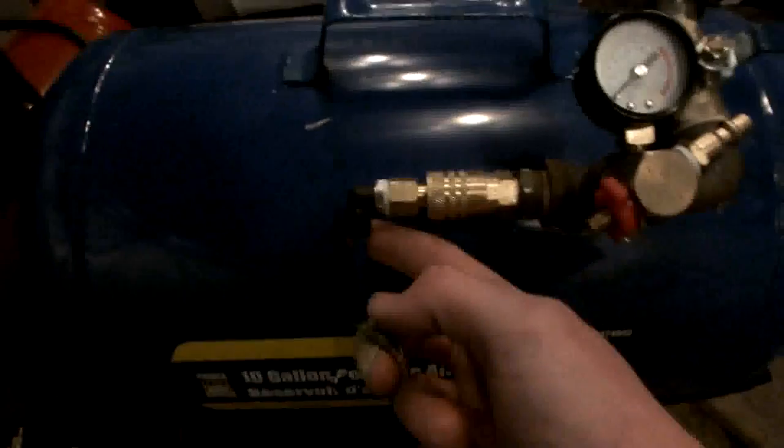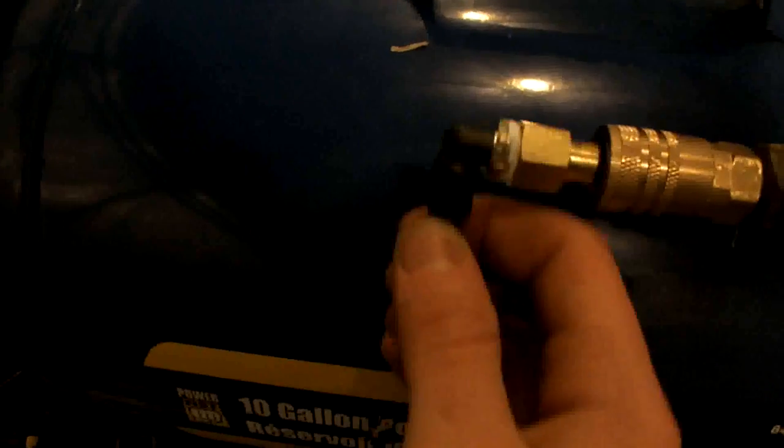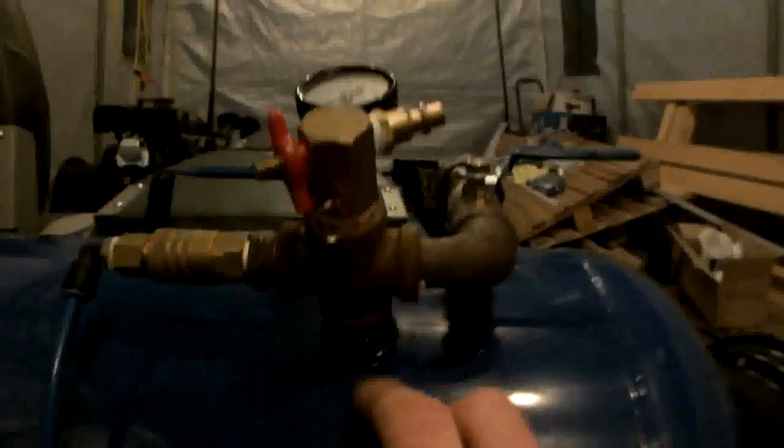This gets followed back all the way under here and up to here. Here we have a right angle pneumatic hose fitting onto a male M-type air plug. That gets connected into there. And this is the big reservoir air tank for the air horns. So it gets charged through here, and then this gets charged up to 100 PSI. It then goes through a 1/2-inch air line to another ball valve.